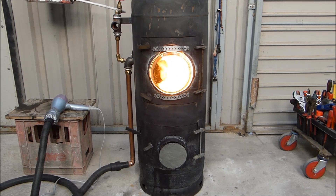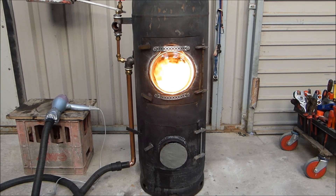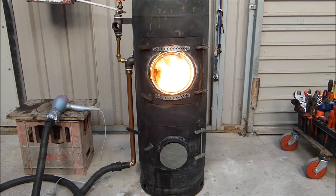My other motor is a continuously rated motor — it's just a converted standard domestic oil burner, and it works really, really well. I just did this to see if it would do it, and as an indication of how much air you would need. A small standard domestic hairdryer on its lowest setting is capable of doing it — you just find yourself a fan that can do it and you can put one of these things together. So there you go YouTube. If you like this video and found it helpful, maybe click the like button, comment or subscribe. Thanks very much, I'll see you all in the next video.